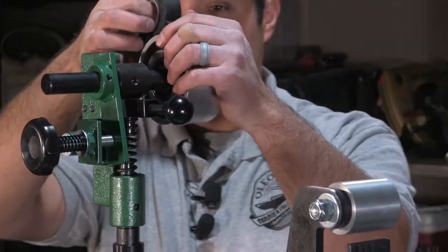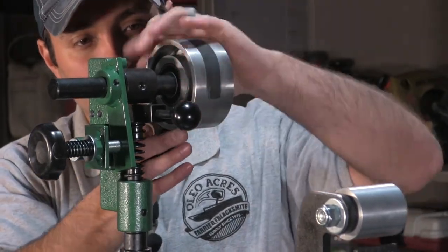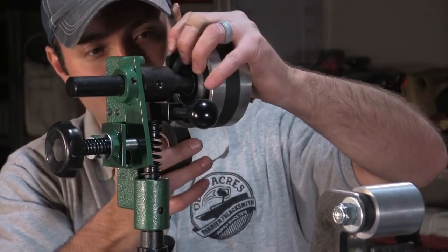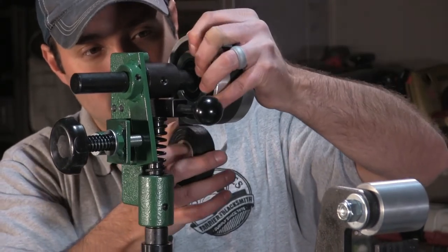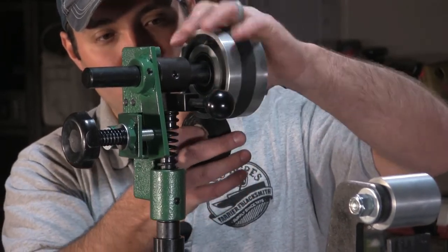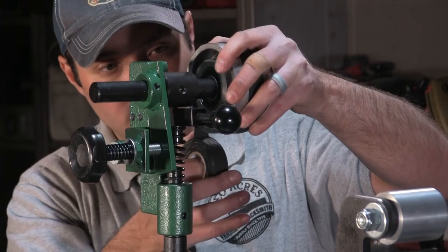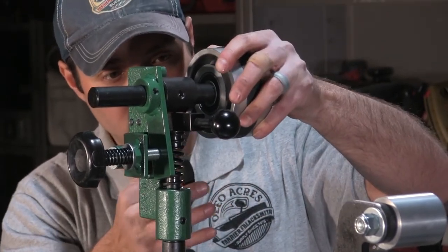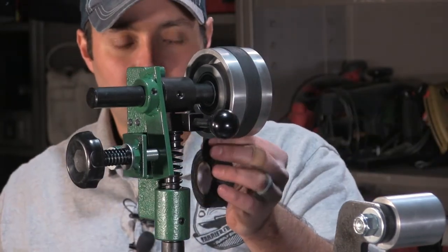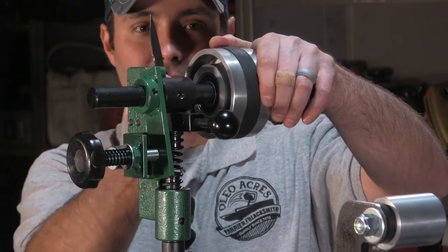And you want to then take your tape and roll it onto the wheel. It's important to try and keep it dead center, because that's what's going to keep everything centered on our grinder. I like to make about four passes with the tape before I call it good. Then just take your knife and cut it off and make sure it's firmly pressed down.